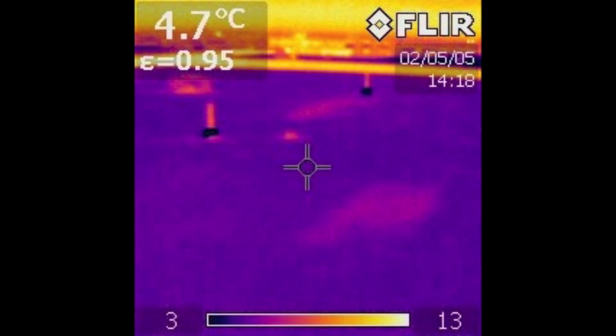Here is another photo showing two areas of wet insulation. Those pipes there are plumbing stack exhausts, and in the middle there's a little circular heat loss area — that's actually a roof drain. The drains lose heat too, but those two blobs are wet insulation. We put fluorescent spray paint around those at night, and when we come back to repair or resurface the roof we cut out those two blobs and fill them with dry insulation.